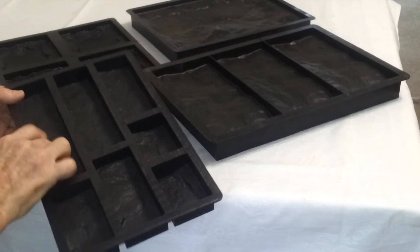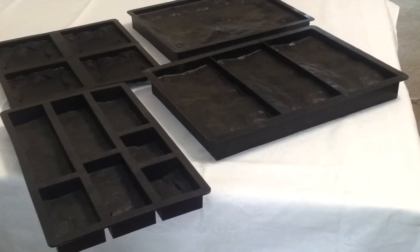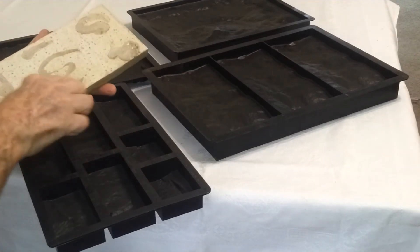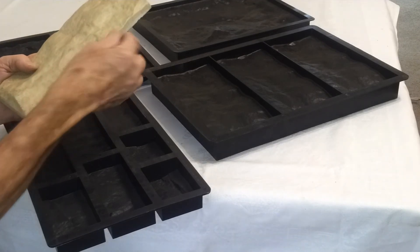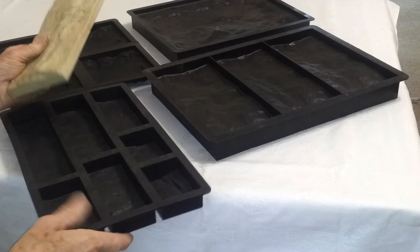Sandstone texture on all the moulds. Once stones are made, they are affixed to the wall with tile adhesive or, as you can see here, with silicone. No need for tile spacers as the joints abut, so no grouting is required for the stones at all.